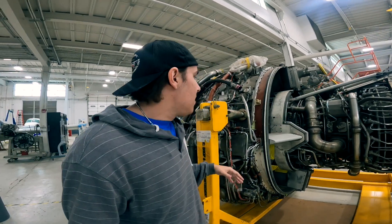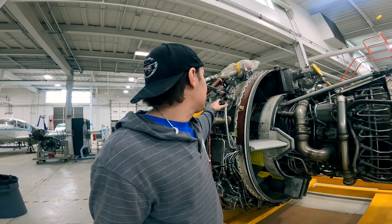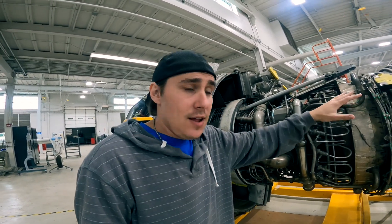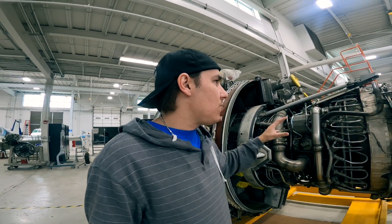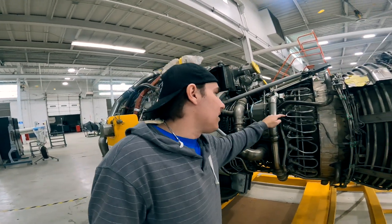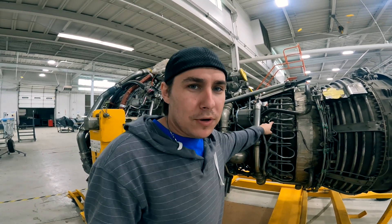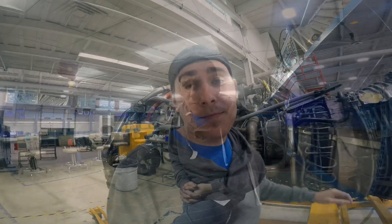When you actually discharge the fire suppression system, it's just like a fire extinguisher going off. Where that fire extinguisher agent is going to go is all around the outside of the engine — none of that agent actually goes through the engine. Because more than likely, if there is a fire, they're banking on it being out here on the outside, since there's already combustion happening down inside the combustion can, and you don't want to put that one out.